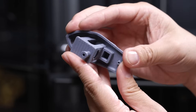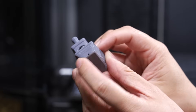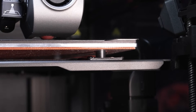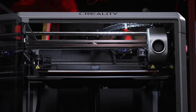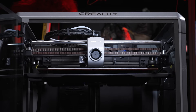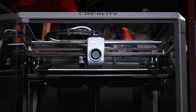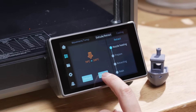I don't feel like you have to use Creality Print because the interface isn't for everyone and there are still a lot of features they could improve. There's also auto bed leveling — instead of using a sensor in the hot end, there are three strain gauges underneath the bed itself. Before every print, it runs through a calibration test to make sure the bed is level, and a sensor in the extruder measures the Z height. I had basically no problems with the first layer of any of the prints I ran on the K1 Max — incredibly reliable, whether using Creality's PLA, their Hyper PLA, or generic PLA like Matterhackers Build Series.